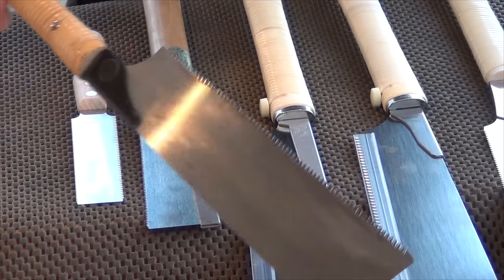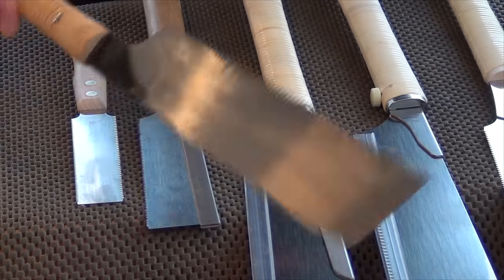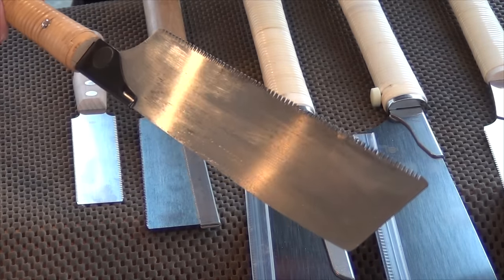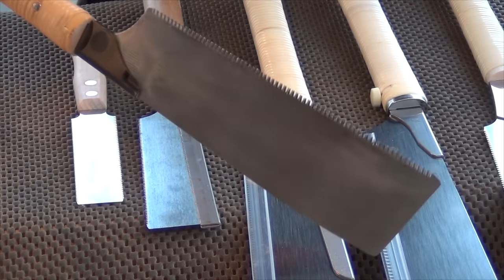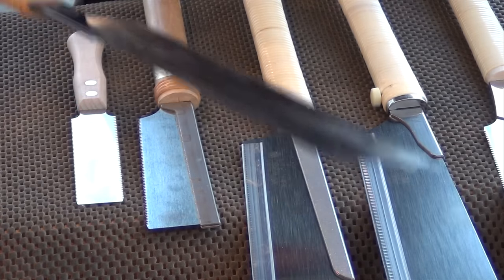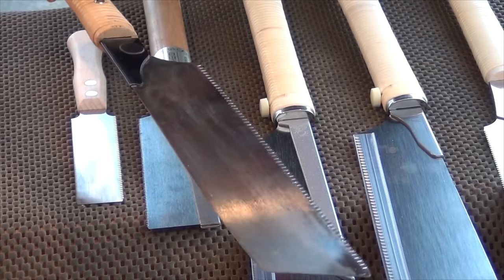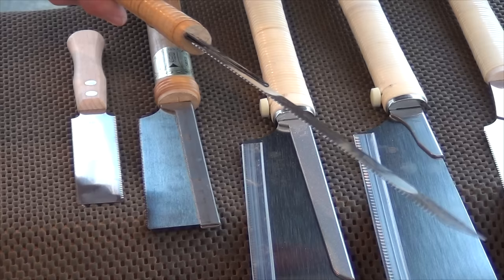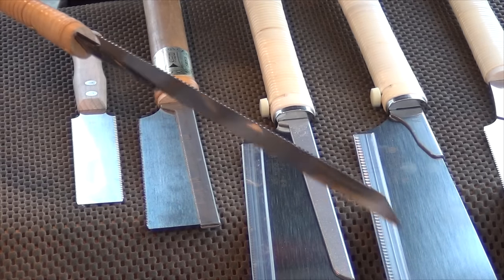I'm reasonably happy with the performance I've got out of my saws — that is the only tooth I've ever broken. I have cut some western hardwoods and exotic hardwoods without any problem. I think it really comes down to how you use the saw. If you try to force the saw or cut too fast, then quite possibly you will break a tooth. This saw is 15 years old. After that initial hard job, I knew I wanted Japanese saws and started getting other ones, using this one for any rough work. It's only now just starting to get a little dull. You certainly get a lot of life from induction-hardened teeth — probably half a dozen times as much work as from a western saw before it needs resharpening.